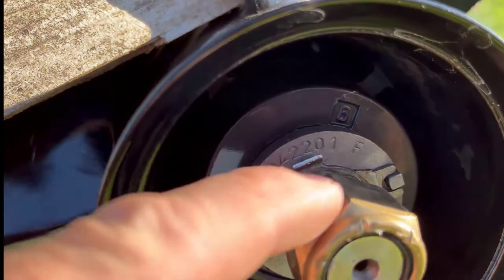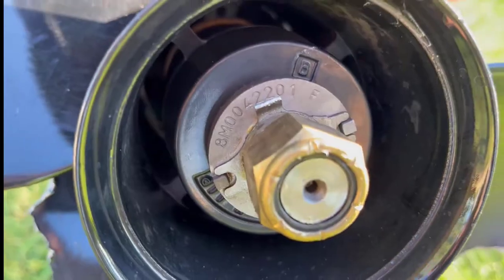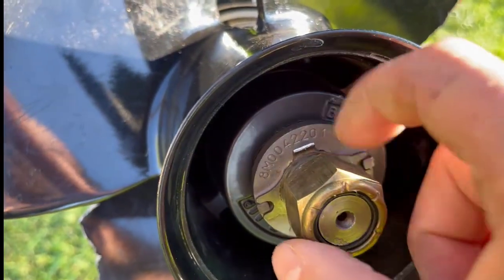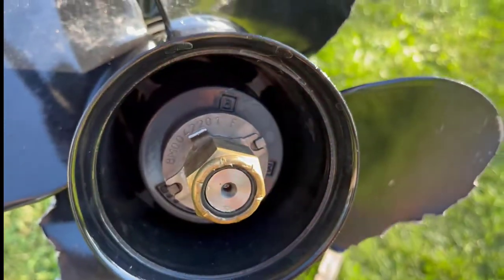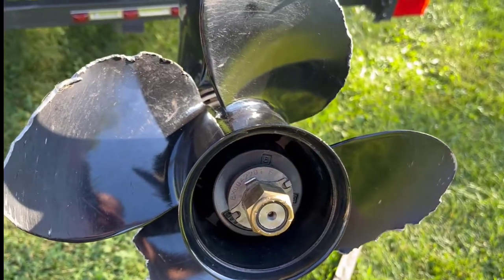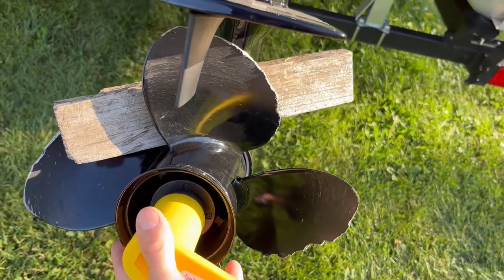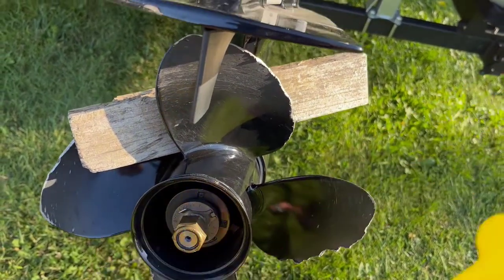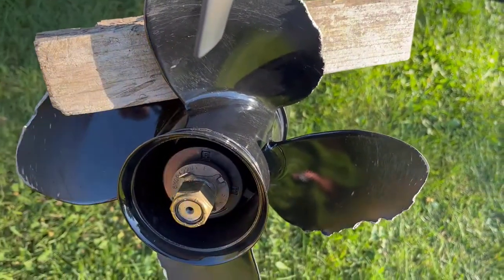Before you use the floating prop wrench, you're going to make sure that you have a tool to get in and loosen these locking tabs. You can see the locking tab right there — it's bent over typically and acts as a cotter pin. The old cotter pin style would go right through the shaft; this particular unit is going to be bent up against the nut. I've already loosened it and bent it out on both sides. Then we're going to put the wrench on with the 2x4 in there and loosen the nut off so we can remove the prop and the hub assembly.